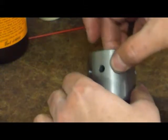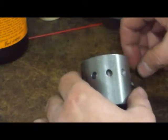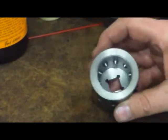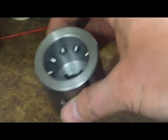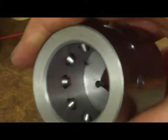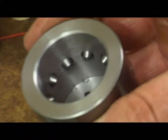I'm just showing how this is going to work when I put them in for good. I'll take that main shaft out of the transmission, slide this tool over it, then push these pins in, and weld them on the back side. That way they'll be set at the right height. That right there will engage in the splines on the tractor on that main shaft. That way I can take my torque wrench, get on this square that I cut the other day, and check the preload on the main shaft.